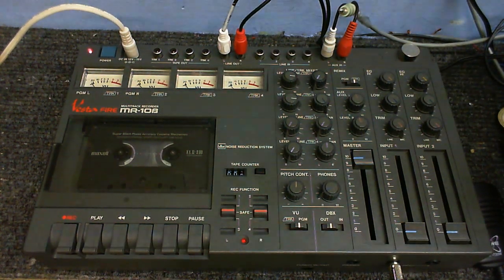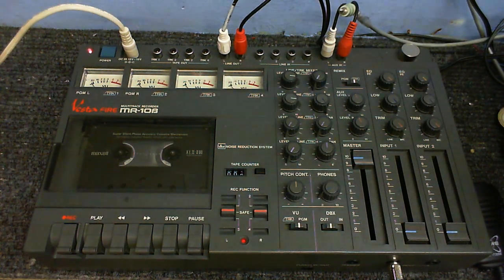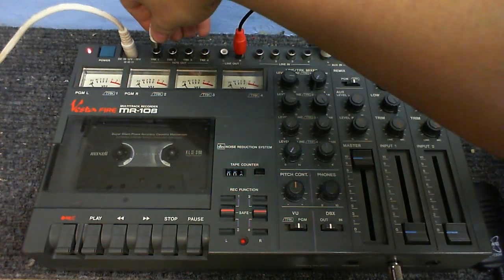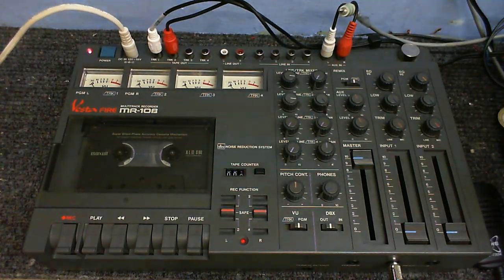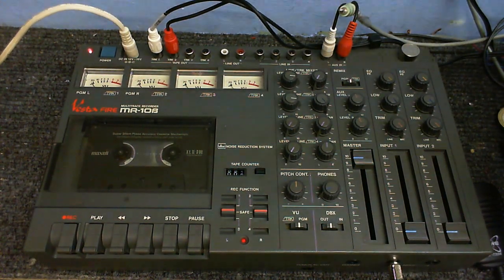And now I want to add a voiceover track on track 3, but listen to the tape while I'm recording that track, and I don't want it to copy anything over from the tracks that are already there on the tape. So, how am I going to do this? Well, first, since this is on tracks 1 and 2, plug those into track 1 and 2 on the tape out. Put the remix into PGM so nothing gets copied over from the tapes or the line in.